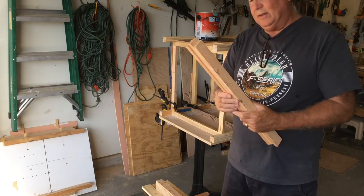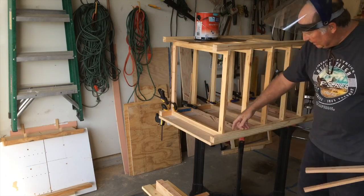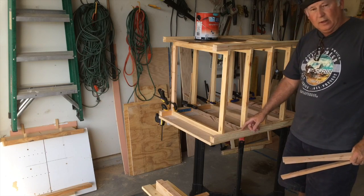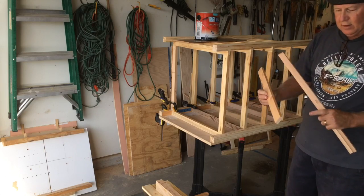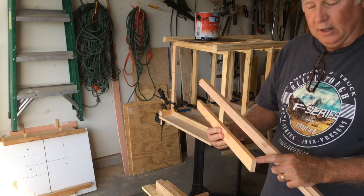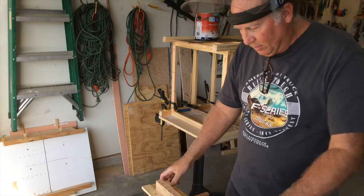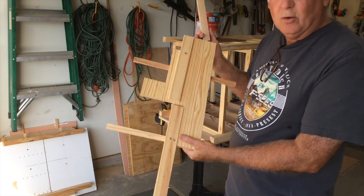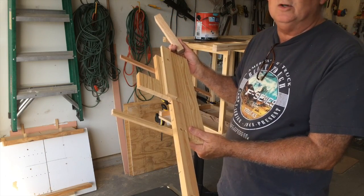I have 50 of these pieces to cut. These are going to be the sides that will fit in the dado cut on the side of the dresser — that's a half-lap joint, so a quarter-inch deep by a half-inch long. I built myself a little jig so I could cut three at a time; otherwise I'd be here till next Tuesday.